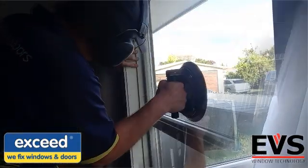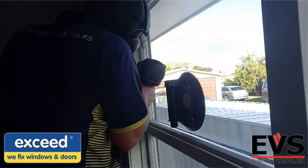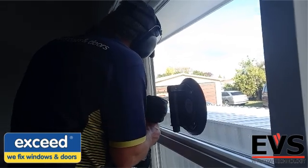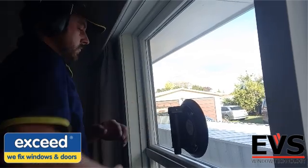It is important to make sure that the seals fit neatly, and don't squash against the window. Once the seals are fitted, then the hardware can be reattached. They will need to be relocated into a suitable position about 9 mm from their original locations.